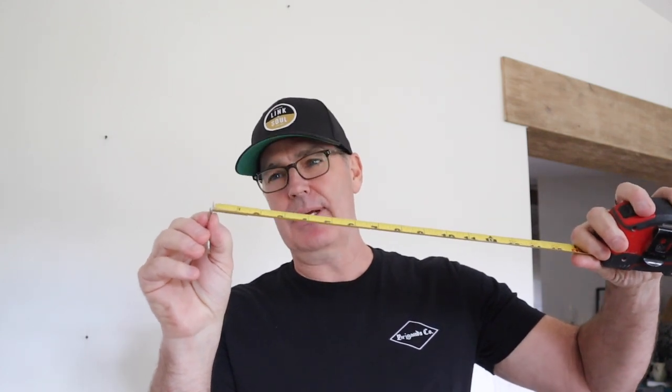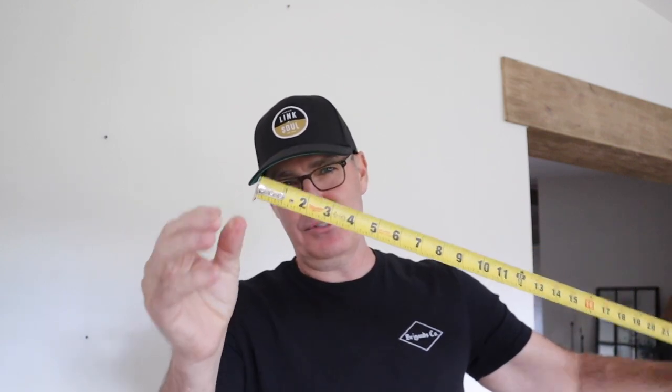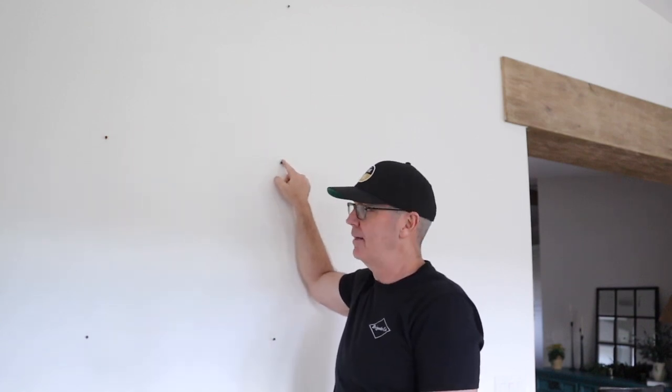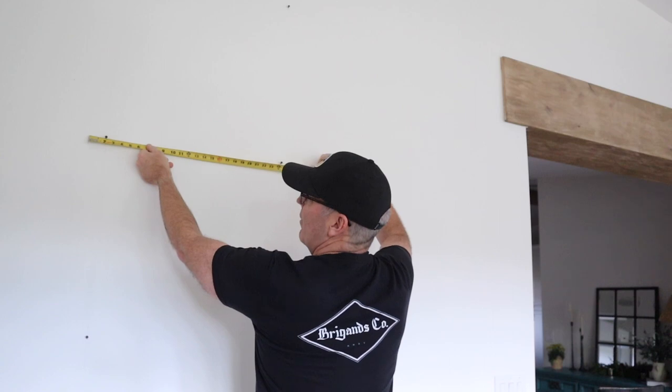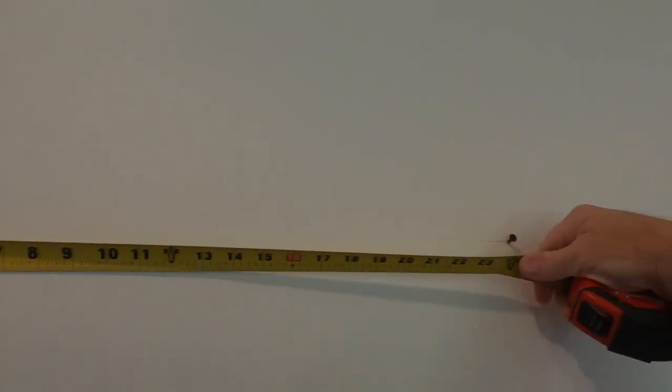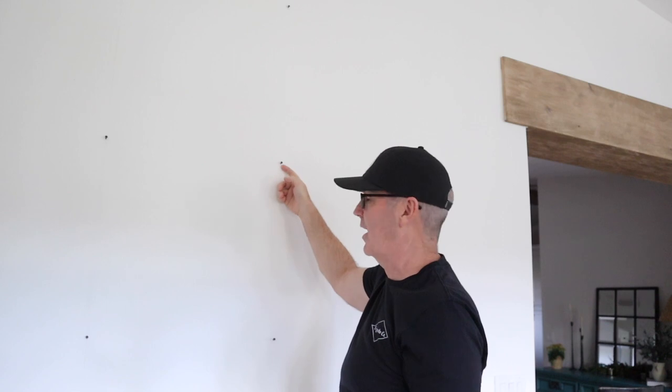Now that I've got that 22.5 inches — whenever I hang anything, I don't like to use the hook on the end of the tape measure when I'm measuring. There's a little give there, as you well know. So I start at the two-inch mark where there's a line and go out 22.5 inches from that. It's just nicer to have a solid line to line it up with instead of a little bit of give in the hook. I've got my center point right here. I want to put a picture over here, over there, up, down. So I line this up with the two-inch mark on that point and then go 22.5 inches away and make another mark right here.